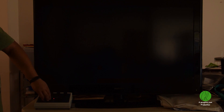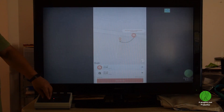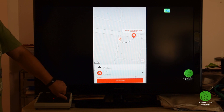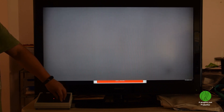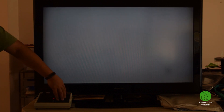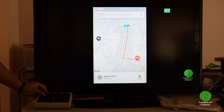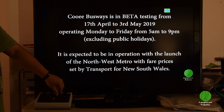As the level is set by an analog potentiometer, the same effects can be performed for practically any shade of grey. The circuit is rather simple, operating based on masking the output with the generated voltage level based on timing reference to the horizontal and vertical synchronization pulses in the video. The final feature is the enhancement feature which sharpens the image to counteract the loss of high frequencies in dubbing.